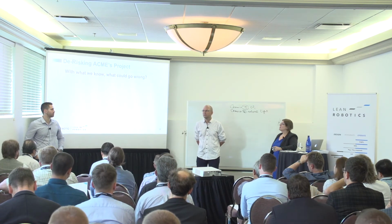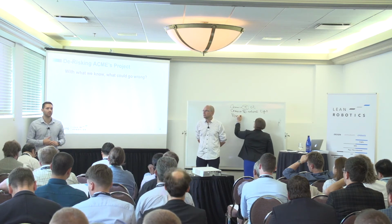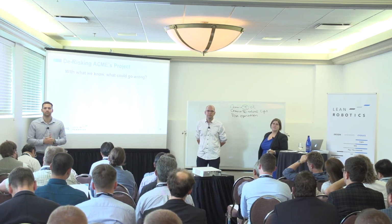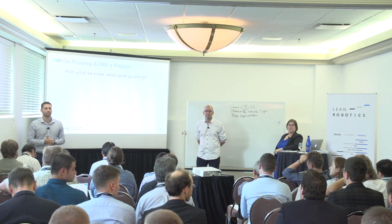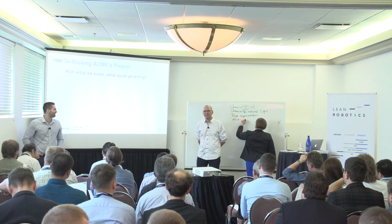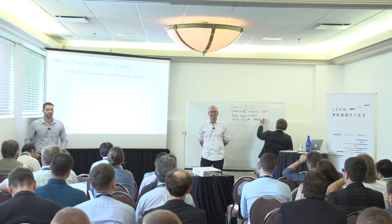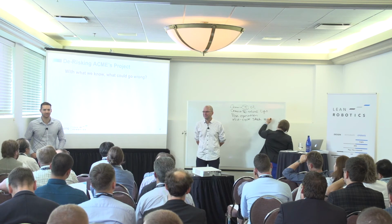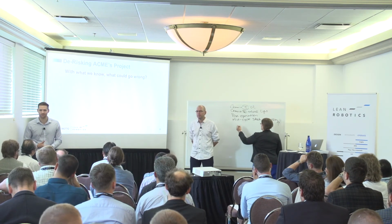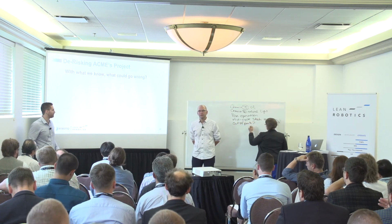Another is making sure that the vise opens and closes properly for the machine. So basically getting feedback and establishing communication between the robot and the CNC machine. What happens if an operator replenishes the stock in the cycle? That's the worst case. What can the operator do during the process? What happens if the robot doesn't have any parts to put into the machine anymore, for example, if the operator took a coffee break and forgot to give parts to the machine?